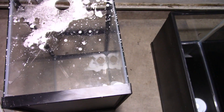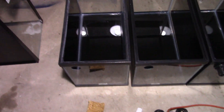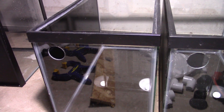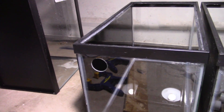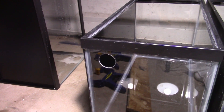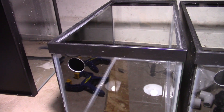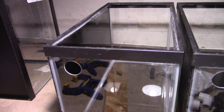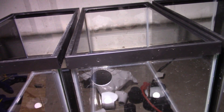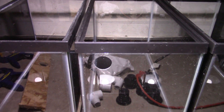On the other tank I practiced and got the hole to go through fine. When you first get it started, go a little slow for the first few seconds, then get it up to full speed. I tried two different drills — a DeWalt 20-volt battery pack, which works pretty good, but it tends to get pretty hot after doing this many tanks. So I went ahead and used an old electric drill, and it seemed to work a whole lot better, holding its speed better since it's not constantly draining a battery.